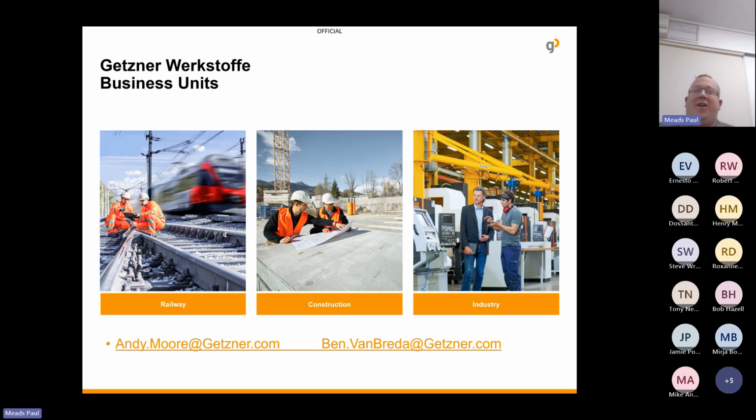This one is more for some of my engineering colleagues. They are more the experts, but what we are finding, we have products, so as you can see, you can mitigate noise and ground-borne vibrations through the use of our materials. But it depends what's already there that's probably causing the problem. If you have a problem with rail grinding corrugation, the first thing I would be looking at is the fastening system and the rail pad. If there's elasticity in there, I always think of it as the bending line of the rail, just over a shorter area. Whereas if you have the elasticity further down the track, you're adding elasticity throughout the whole system. But it would be a better question for one of my engineers.